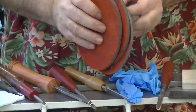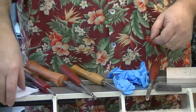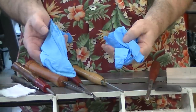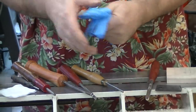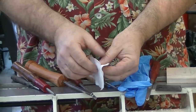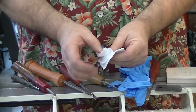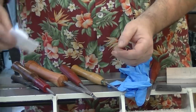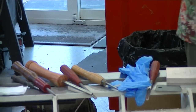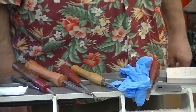Then 360, 500, and 1,000. I'm going to use disposable gloves when I finish because I don't want the finish to transfer into my skin. And I use these gun patches to apply the finish — they're small, disposable, cheap, and they apply the finish really well. For the finish, I'm going to use a friction polish.